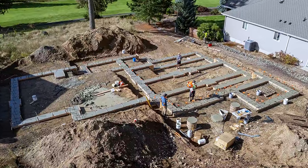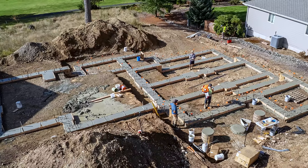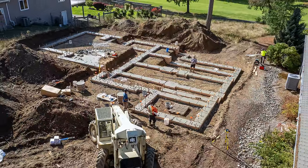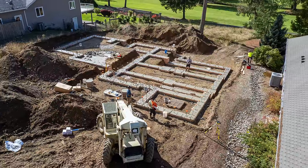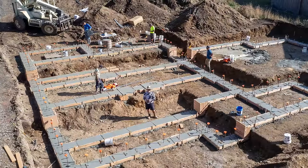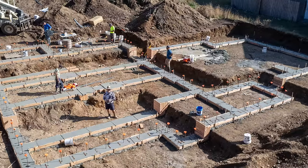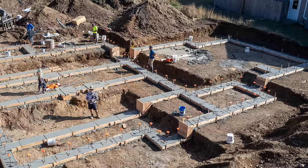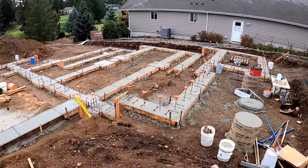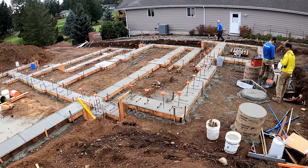It's not even messy — how's that for concrete work? And whoever gets to live here has a beautiful view of that golf course. One of our games is to always dial in the yardage as close to perfect as we can. All that was left was what was in the hose. We don't order like maybe two cleanup trucks and try to call in yardage — I try to order firm. It's okay to have about a yard extra because it's less expensive to have that yard unused than to have guys waiting around for a late truck.